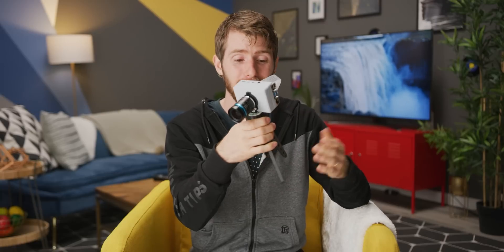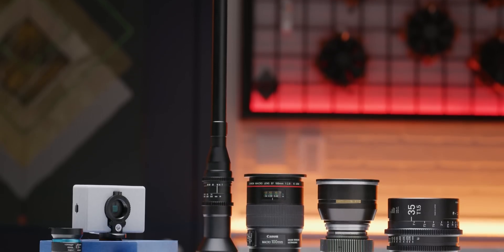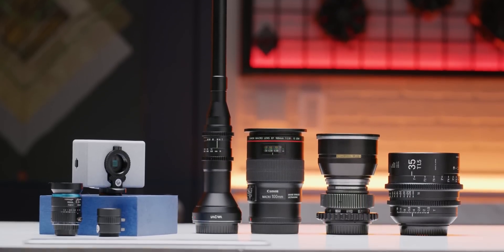You obviously won't get the water resistance or image stabilization that you'd find on a GoPro, but for the price, it actually still looks pretty good. This sensor captures 12.33 megapixel stills in JPEG, PNG, and even RAW, and we can shoot video at up to 1080p, 50fps, H.264. It supports changing the ISO, shutter speed, white balance — all the usual camera controls — and thanks to its C-mount lens flange, pretty much any lens from very cheap to very expensive can be made to fit with the right adapter. You can even do in-camera image processing like balancing colors or adding filters, like an oil paint or watercolor effect to your image.